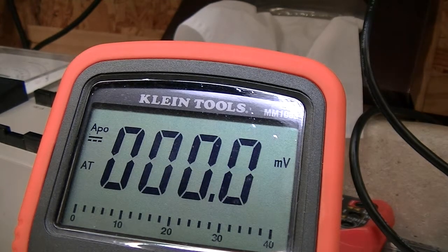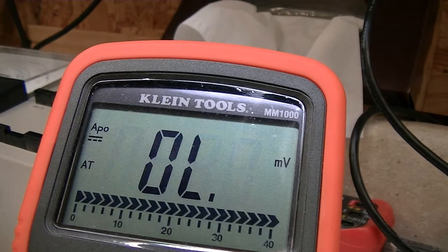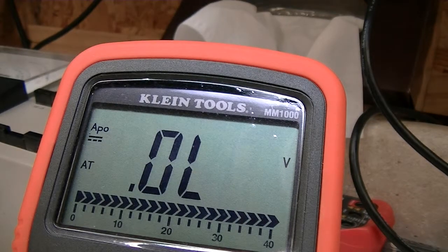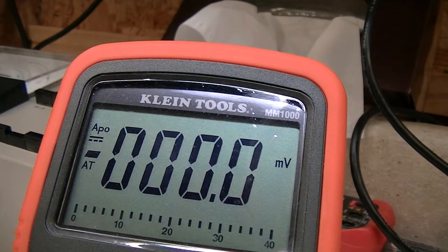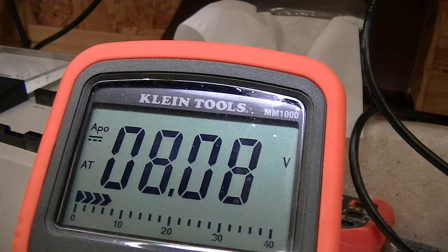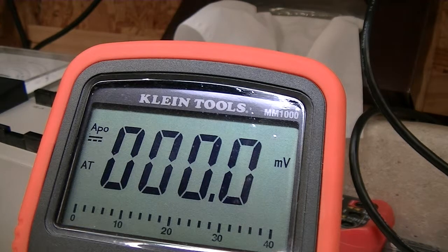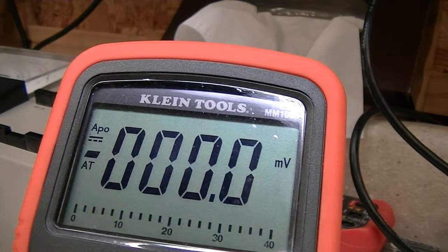Reading 7.94 — a little bit lower but still within spec, since the minimum is 7.79V. Another reads 8.02V. Overall for an approximate 8-volt Zener, this 5 milliamp test current seems to work pretty well. I am a little concerned that if I have a suspect one, testing at only 5 milliamps may not show problems at higher current levels — it may regulate at 5.5 milliamps but not at 50 milliamps. They're all right in the area of 8 volts. They all test good — of course they ought to, they're brand new, but you never know; you can have bad ones from the factory.